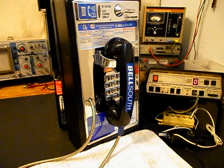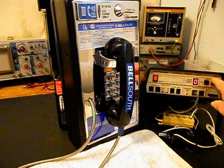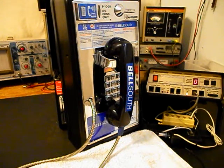We also want to mention that we have an amplifier back by the video. It has a button on it. When I press the button, I can give dial tone or take it away at any time. And since it's an open amplifier, it is prone to any static interference or noise in the atmosphere. So if you hear any noise during the final checkout, it will be coming from the amplifier and not the payphone. Now what we want to do is use the analyzer and send a ring cycle like you were getting a call. So we'll start that. We're going to let that go a few times. I'll let it go one more time and we'll give you some dial tone.